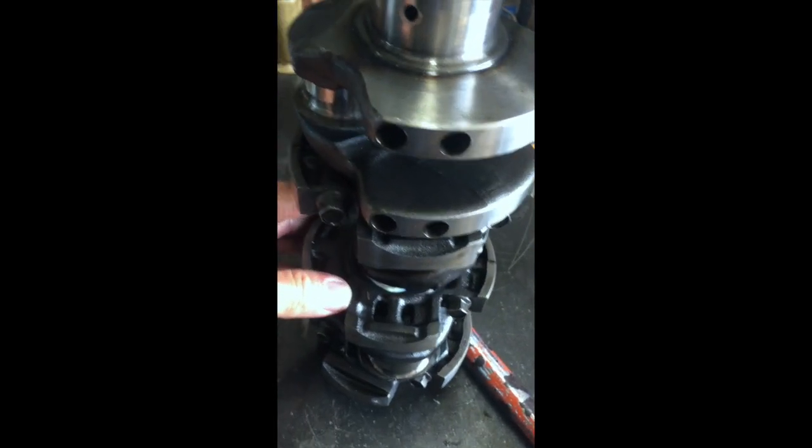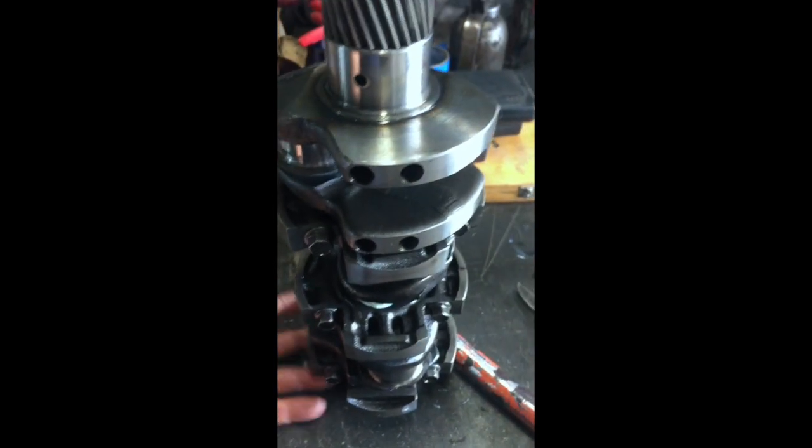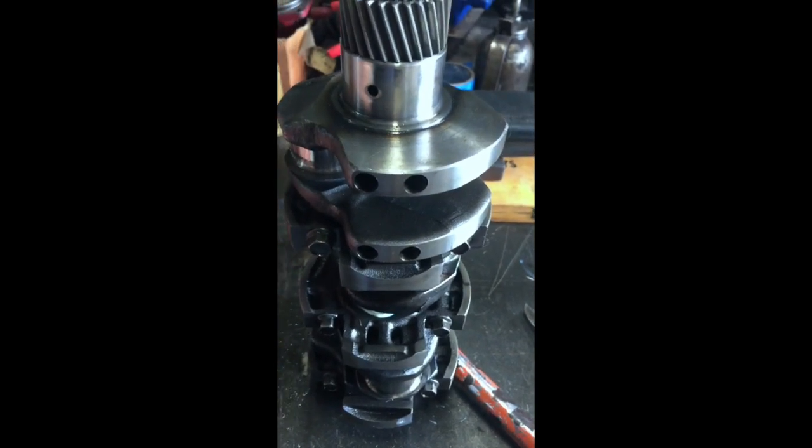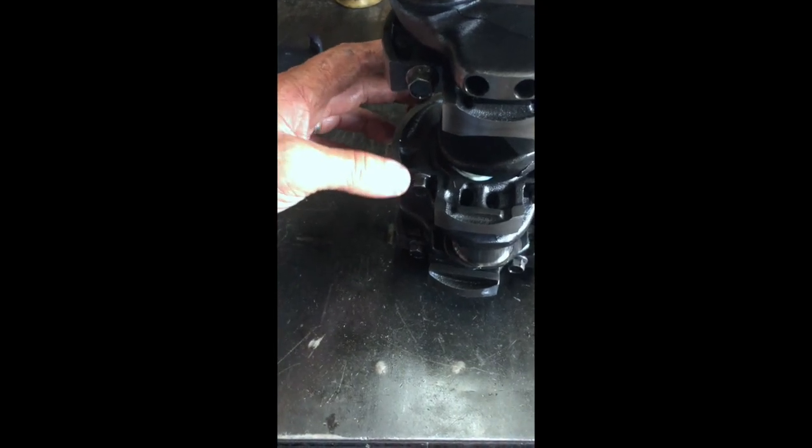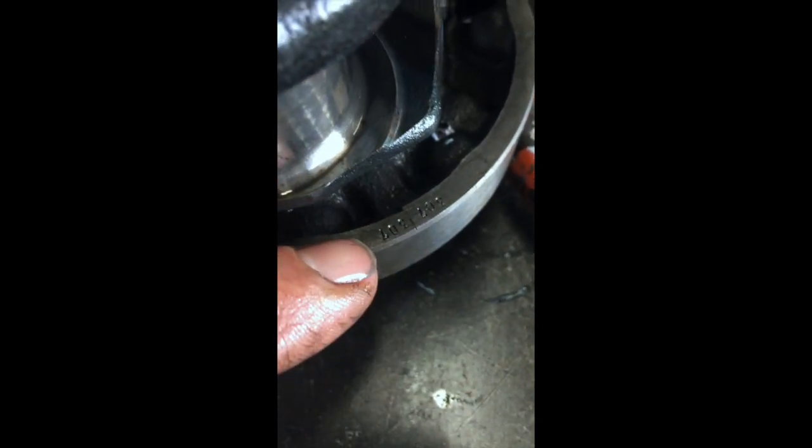These bearing blocks, the back one's got holes in the back, so you don't get these confused. Do one at a time so you don't get them confused. This is like A and B, they call it, but it's actually cast into the back side that it says flywheel on it on both halves. There are some numbers on the mating halves, and they're the same number from top to bottom, so you'll know which way to mate.